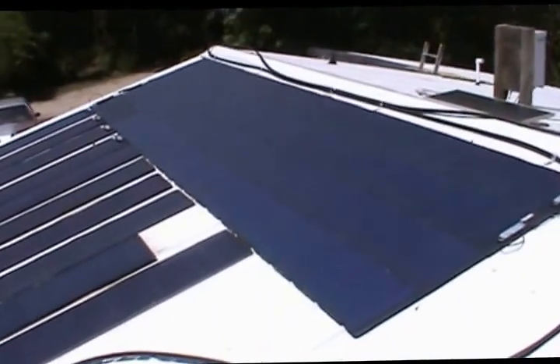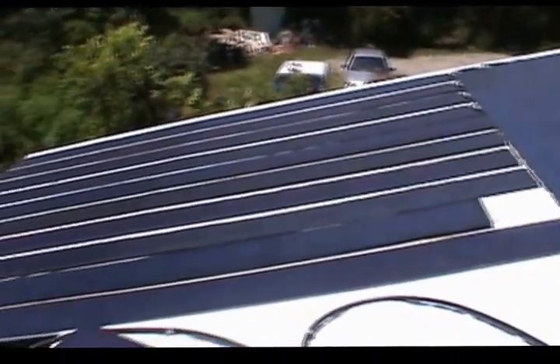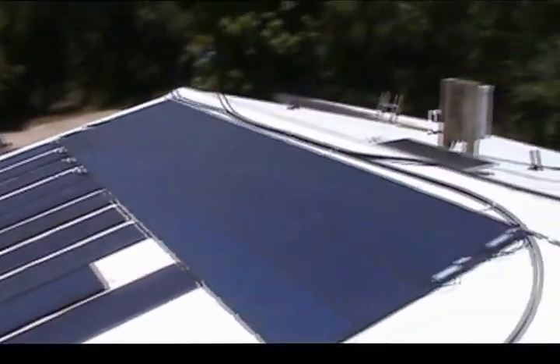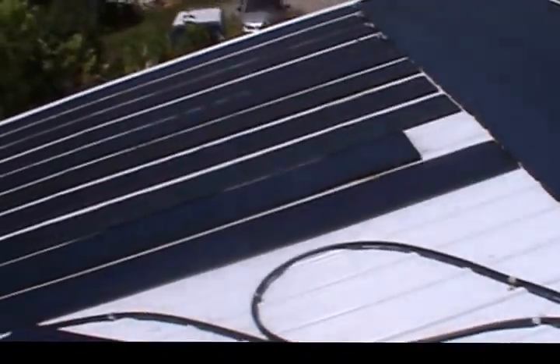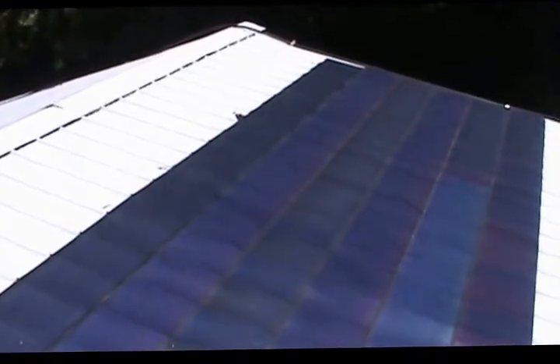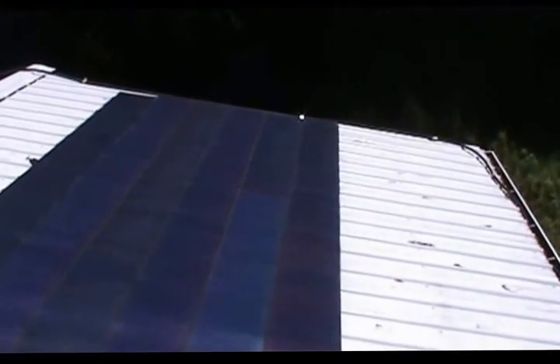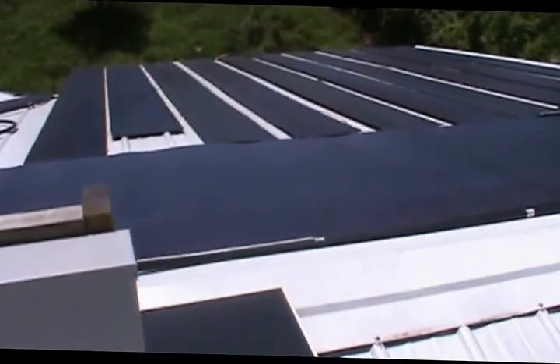Welcome back to the roof. While I've got the battery compartment open for maintenance, I thought I'd explain the whole solar power system to you. I've got roughly 2.7 kilowatts of these UniSolar flexible self-adhesive panels up here. They're designed to go on a 16-inch standing seam roof running this way, but they also adhere to the flat surface between the ribs. This roofing is about half the price for the same gauge metal and same paint warranty. Those panels are connected in strings of three in series.